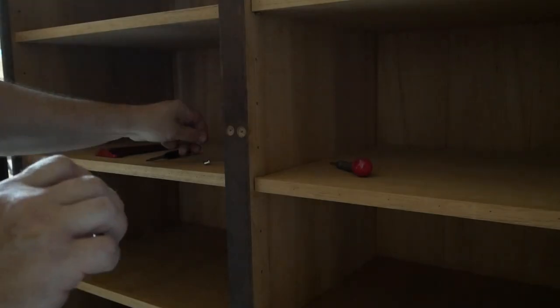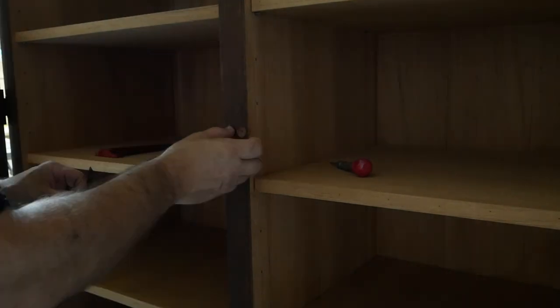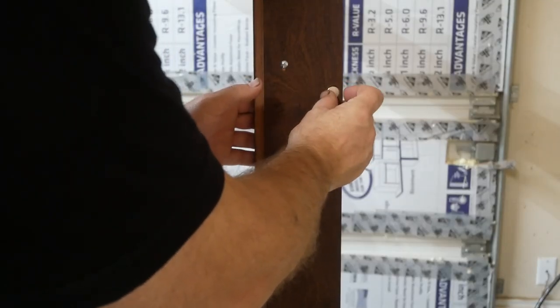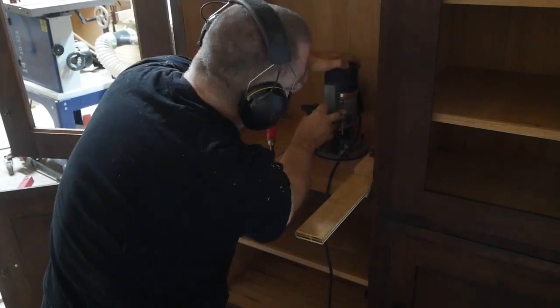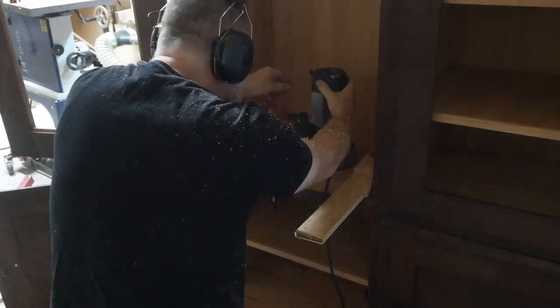Still enjoying my cigar. I'm going to use some fasteners and some magnets. Here I'm drilling for the magnets using a Forstner bit, and using some epoxy to put those magnets in place. I'm using a center finder so I can press the door up against it and know exactly where to drill for the magnet. And here they are — they just close right up.